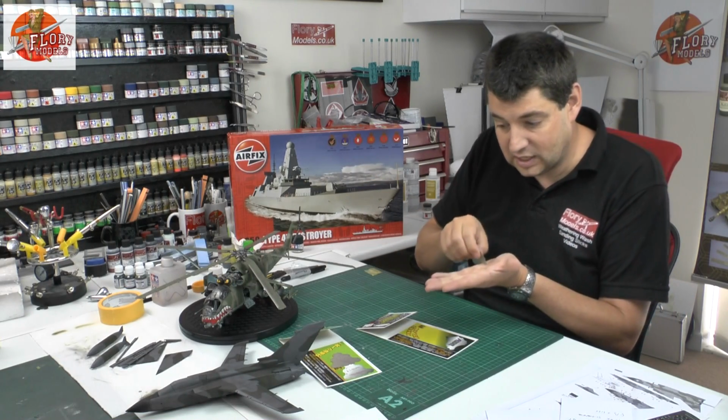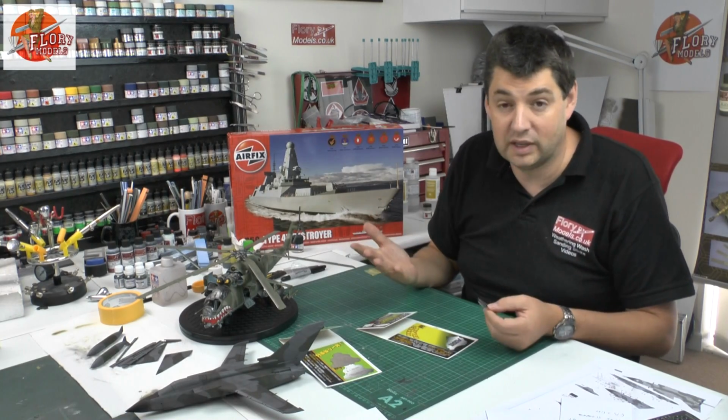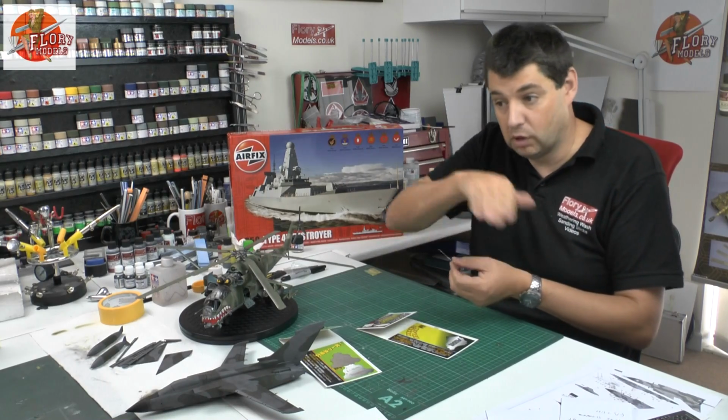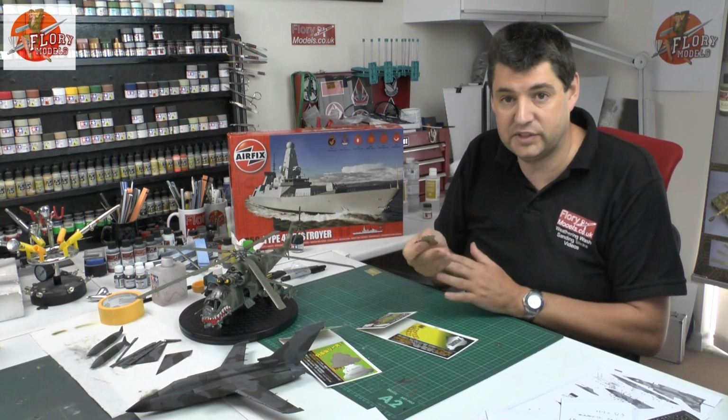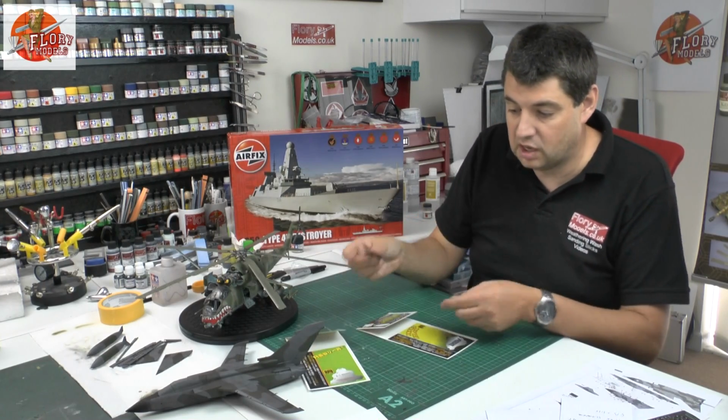Although you're going to take away a lot of the detail by scrape cleaning it, you're going to lose it anyway because you're going to sand it. This way, at least you've got the curve on it. So actually you're going to do less sanding. So you can be more precise with this, scrape clean them down, especially with these curved edges and stuff like that.